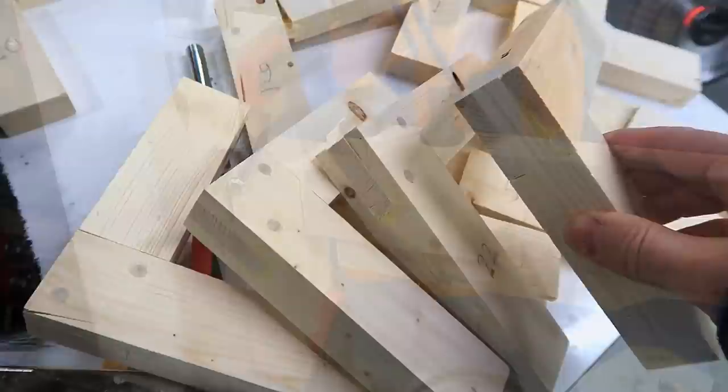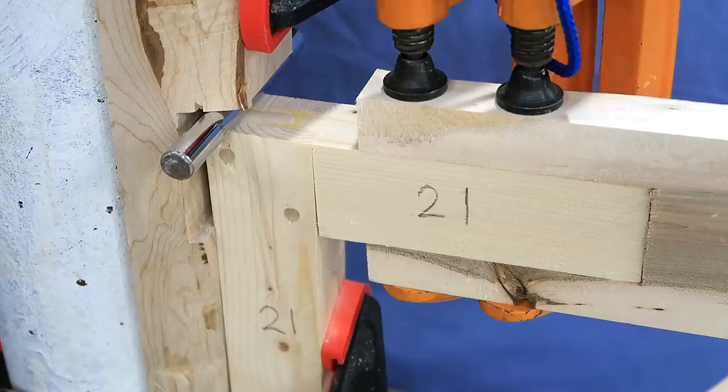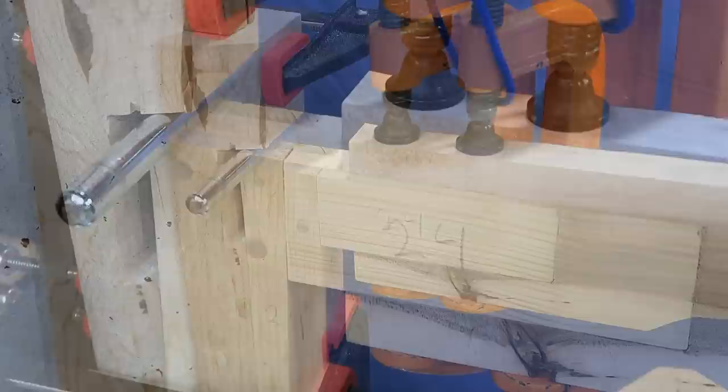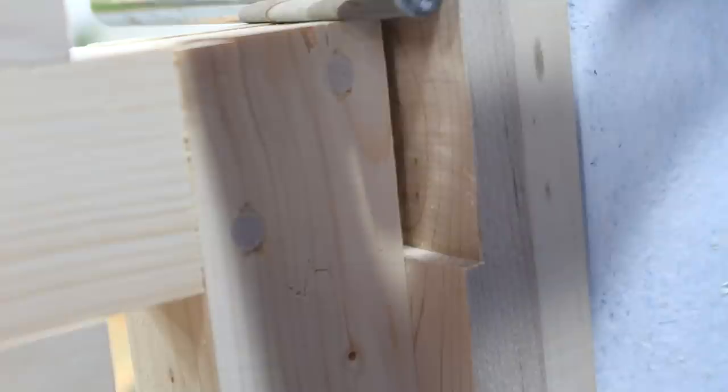I also made some test pieces out of somewhat thicker material. That was 100 kilograms — there's a glue joint failure right there, but only partial. Mostly a glue failure. Then the glue failed and we're just pulling on the pins; the wood came apart so that pin doesn't pull anymore, and on the back you can see a crack that's formed. Here are my results numbers and bar graph.